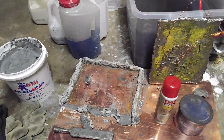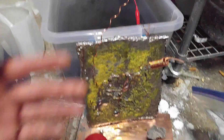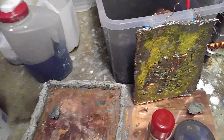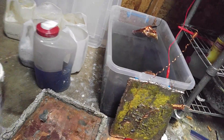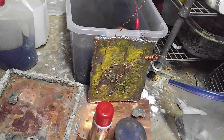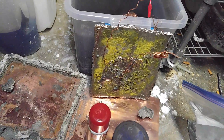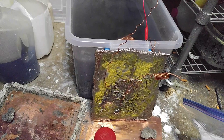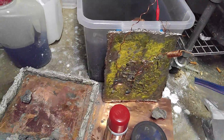This is the making of a bismuth plate for GANS production. There's the finished product — you can see by the size of my hand it's a rather large plate. I started with 20 pounds of bismuth and ended up with that. This is actually my third bismuth pouring, and I find that the plate needs to be rather thick, otherwise it will crack on the separating or pulling up from whatever medium you pour it on.